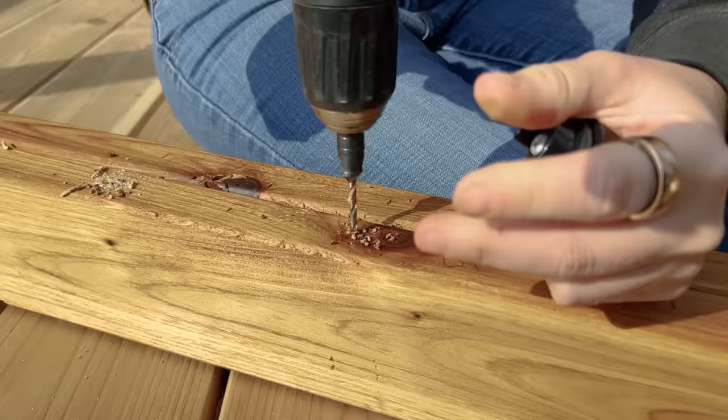That is three different types of railing on this deck. If you're still hanging with me, let me show you the finishing touches, which is adding a top cap. This is just a small detail — run it through the table saw and put a nice little bevel on it. To secure it I use a pre-drill to go in from the top to secure any end that was on top of a post. I'm using stainless steel screws here because galvanized will leave black marks on your wood once it gets wet, but stainless won't. I'm using my combination square to make sure the overhang is uniform all the way down the line.